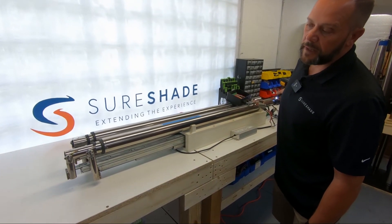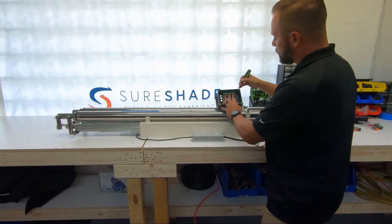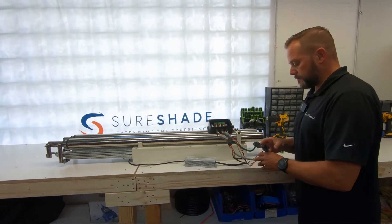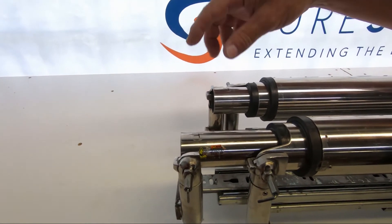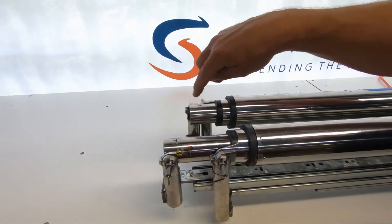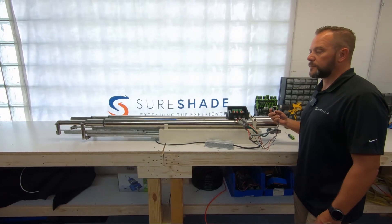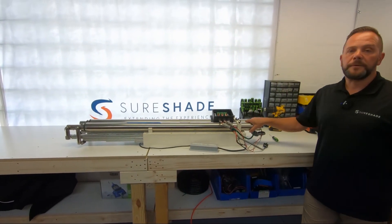Put the drill in forward and use this to get your one-inch measurement. Once you have that, remove your drill, come back into your control box, turn off five, turn on seven, hit set, then turn it off. Note that this tube was extended intentionally for demonstration so we could over-retract the actuator — normally both tubes would be the same size. Now we've reset home, and both actuators are back and working.